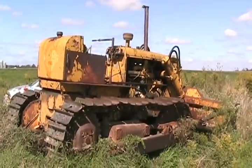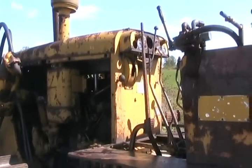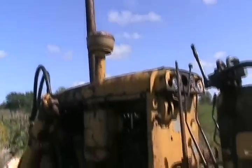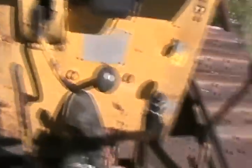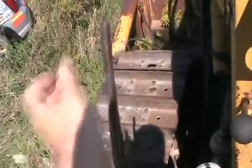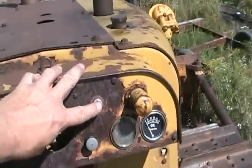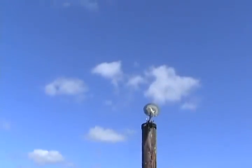Around 1958 or '59 they switched these things over to having a torque converter instead of a manual clutch. So now I'll start it up for the first time since March — now it's the middle of September — and switch her over to diesel. I just put my feet on the brakes, this is a good place to sit them. Turn the diesel off, pull the decompression, choke it, and make sure it's in neutral. Then push the start button. Take the choke off and she's running on gas.